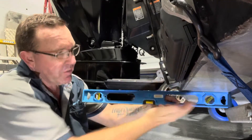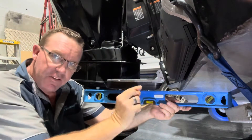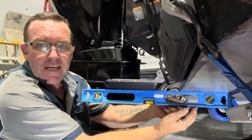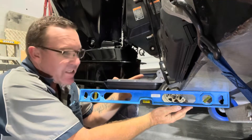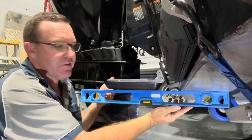I've got my level on the bottom of the boat. There are no planing strakes in front, and looking down the hull there's nothing to create turbulence on this plate boat. This transducer is set high — I've got the level on the bottom of the boat and it's touching the bottom of the transducer, so that's how it's been set. Once it runs up to speed on the plane, too much air is getting under this transducer.